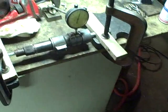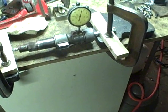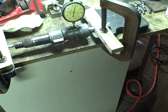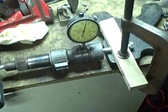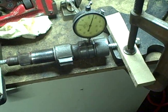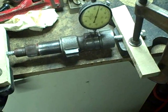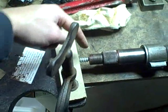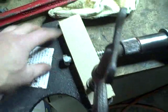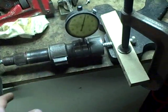Just for laughs, I decided to rig up an albeit crude but rather effective way to find A, how far out of whack this thing is, and B, where the high spot is. What I've got is some lag bolts that the points fit nicely into the ends of the shafts, and I've got those clamped down to the bench, so basically that's my support for my shaft so I can rotate the shaft.